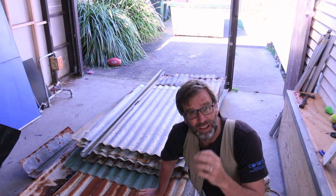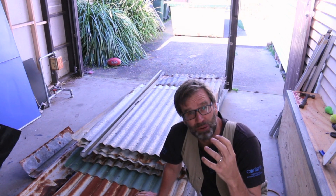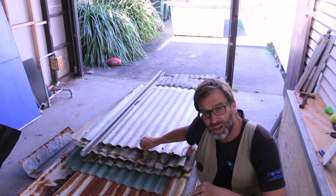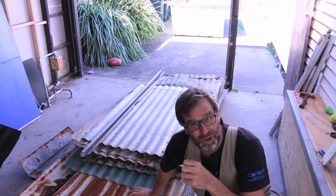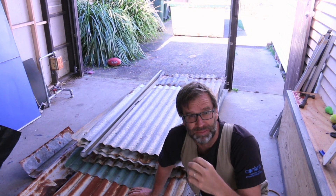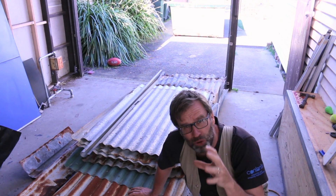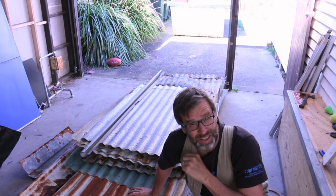When demolishing your project, don't just throw everything into the skip bin — that will just make it weigh heavier and heavier, which will cost you more to dispose of. Stuff like this roofing iron weighs a ton. You can get rid of it by taking it to a metal merchant; they'll dispose of it and might even give you a few dollars for your efforts. The same thing goes for light fittings, bathroom fixtures, or even the timber from your roof or wall framing. Try and sell it all, because every bit counts.